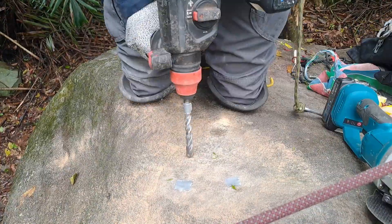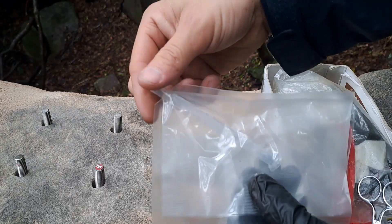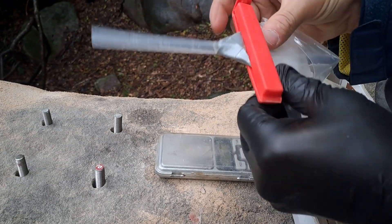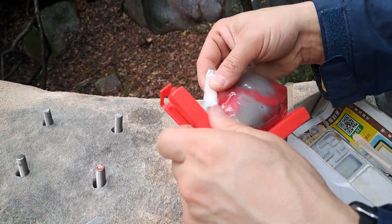The rods were cut with an angle grinder and the drilled holes were brushed and blown clean. I used one year expired Hilti RE500 epoxy with foil packs that tore out of the plastic top. The hardener and resin were weighed to a 1 to 3 ratio, hand-mixed and injected with a DIY squeeze pouch.